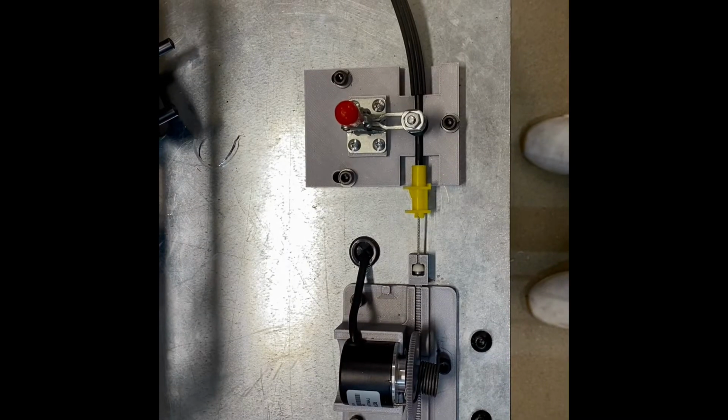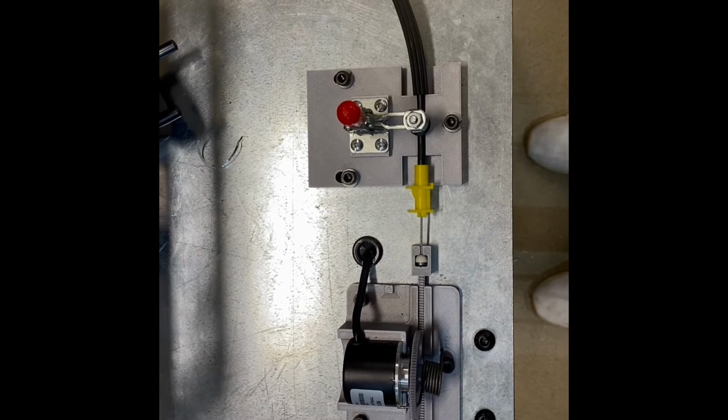As mentioned earlier, the team made a linear encoder out of a rotary encoder using a rack and pinion design. Here the cable can be seen being pulled by the door handle while it pulls the rack and moves the encoder. A torsional spring was added to create some back force to remove any slack from the cable before testing occurred.